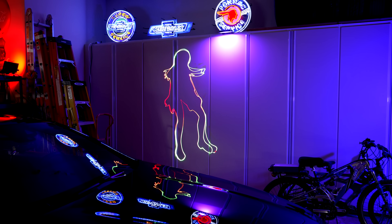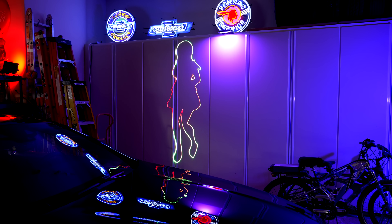Knowing what we've learned so far would only get us a colored beam — a powerful, custom color laser pointer in essence. But we want to move that beam around incredibly quickly and draw pictures with it. Your first thought might be to do what the yoke on an old CRT does: bend the beam through electromagnets to place it where you want it. Unfortunately, CRT yokes are designed to bend an electron beam in a vacuum, not photons in atmosphere. Since photons do not have an electric charge, they do not interact with magnetic fields in the same way that electrons do. Therefore, a yoke from a television would not be effective at bending a beam of laser light.